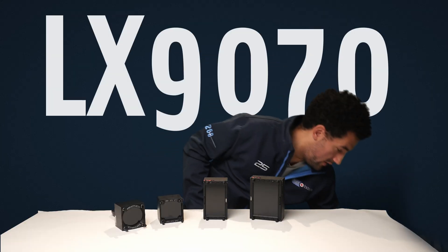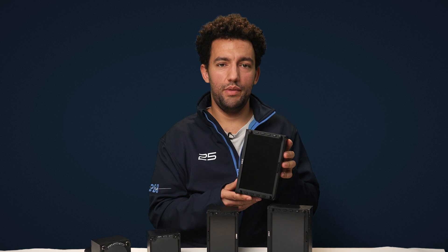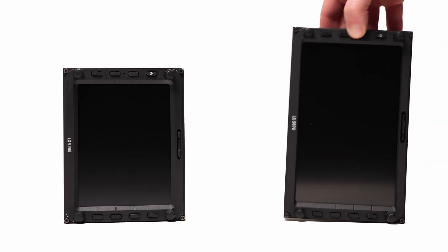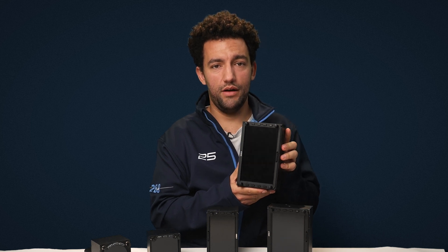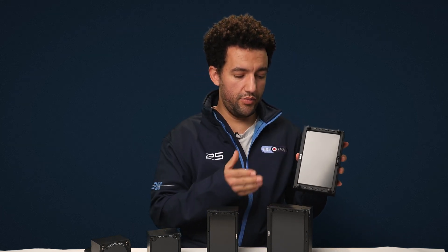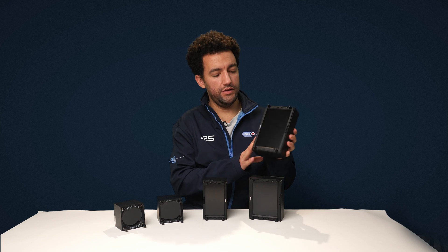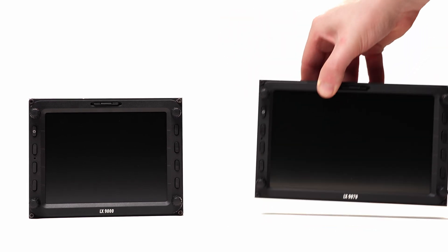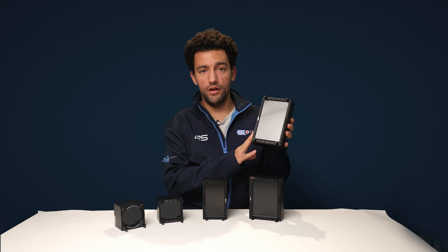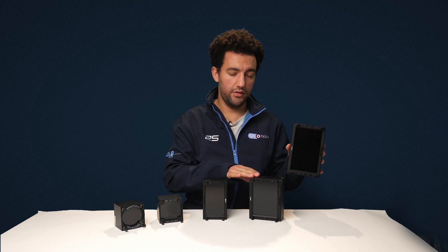Next up we've got the big one, which is the LX9070. The LX9070 has a seven-inch display, which is notably bigger than the LX9000, giving you ample space to display the map or as many nav boxes as you like. The difference in price is only about £350 plus VAT, so most people, if they're able to choose between the two, tend to go for the larger screen nowadays. It's become the industry standard for brand new gliders. The main deciding factor between the two is whether you can fit the height of this screen — the width is exactly the same. On most modern gliders you can now fit the LX9070; on a lot of older Schleicher or Schempp-Hirth gliders like older Discuses or Ventuses you can quite often fit the 9070 as well, but on those where you can't, you should be able to get the 9000 in.